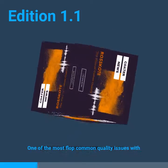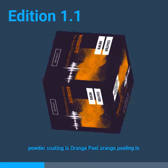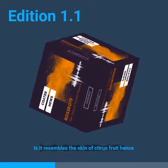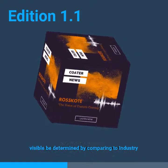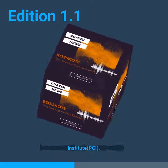One of the most common quality issues with powder coating is orange peel. Orange peeling is defined as an uneven texture on smooth finish products. It resembles the skin of citrus fruit, hence the orange peel name. The level of orange peel is visibly determined by comparing to industry standards typically set by the Powder Coating Institute.